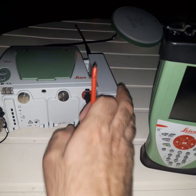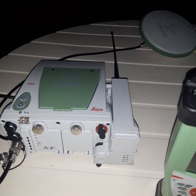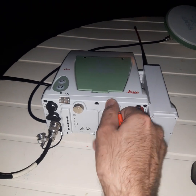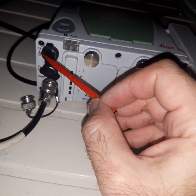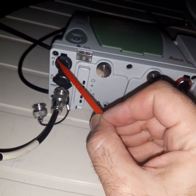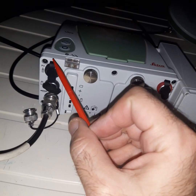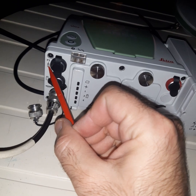This is a part of the base receiver. It contains the receiver, and this is the place for batteries — battery one and battery two. This is the port. The port is very important when we select the type of radio. You can see this P3. Some receivers and GPS connect the radio on port 3, but in this type of receiver we can connect the keyboard on port 3.